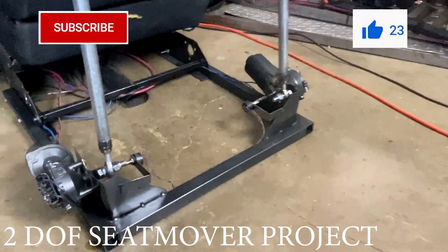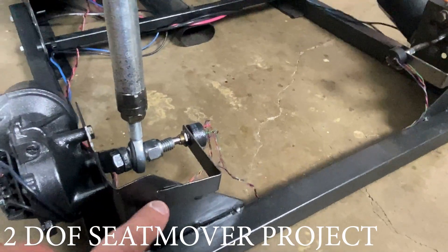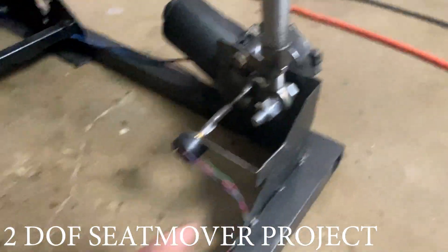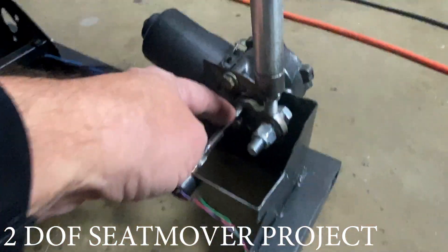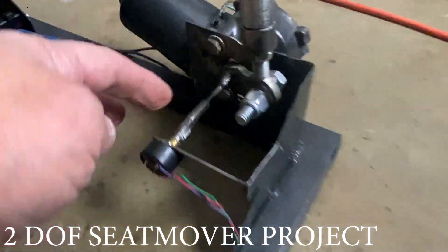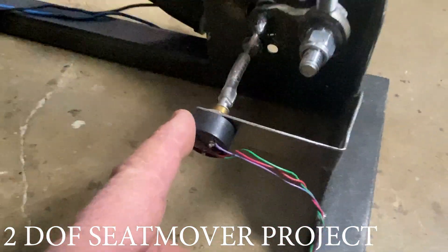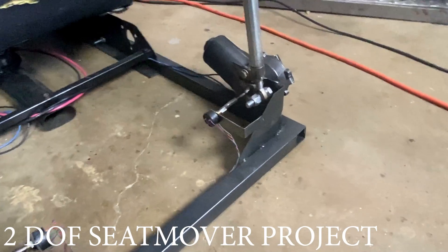Let's take a look at what I've done. I just basically mounted the Hall Effect potentiometers on this little piece of metal here. Those are welded on, these are bent, and the motors are hooked to it. I did the same with both of them — this is motor one and this is motor two. I ended up welding on a screw here instead of that plastic molly, and then I put the flexible airline here. It's not perfectly straight, but these potentiometers don't need to move very far — only just a little bit — and there's no resistance to them.